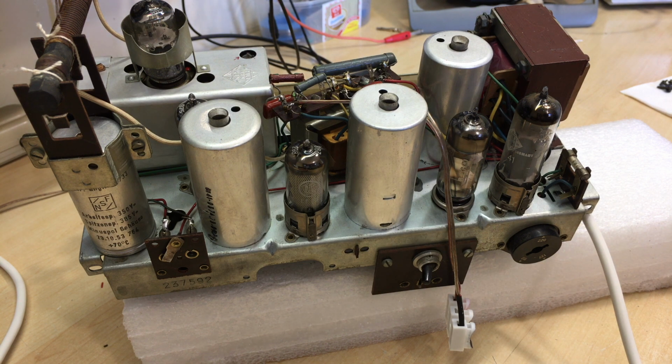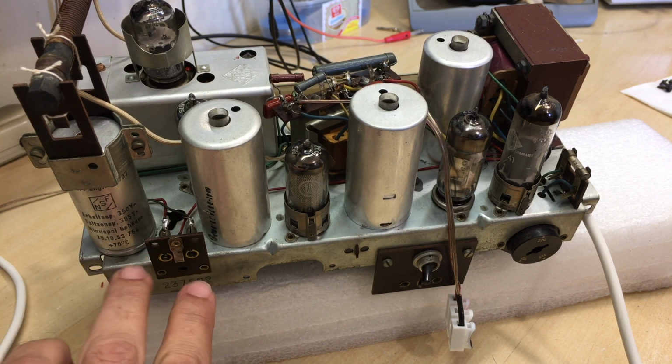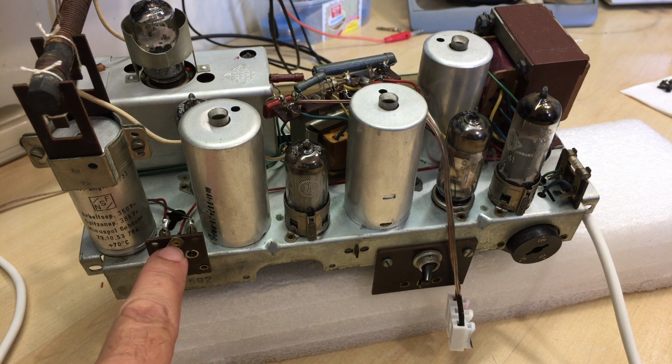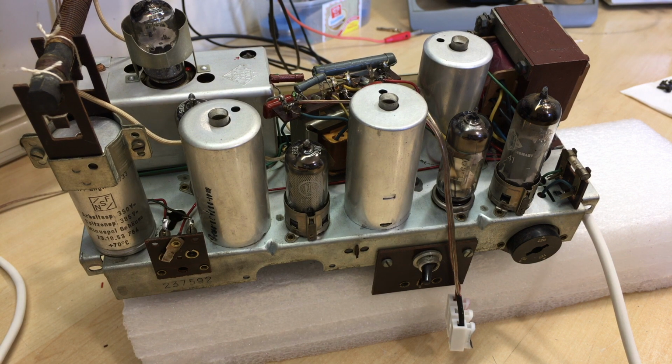I prefer to use an external antenna, but it does allow me to flip it off away from either of the two antenna pins, or I can just flip it back onto one if I choose. I'm going to be changing the capacitor that connects that point internally to the mains. At the moment, I've got a 50 picofarad silver mica cap. I'm waiting for the Y caps that I've ordered. Very strange values, very small values, difficult to get. But they tell me they're sending me one, or a few, so I'm waiting for that.